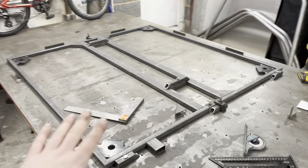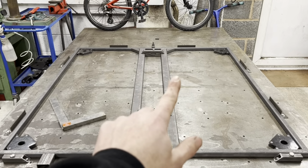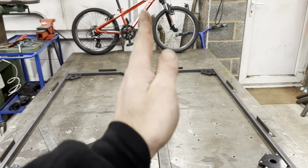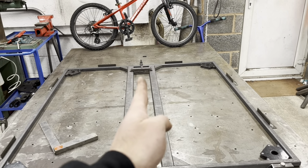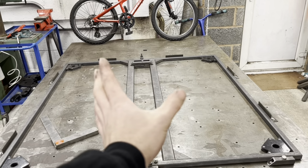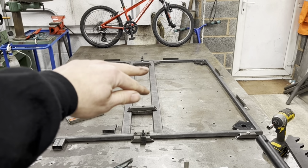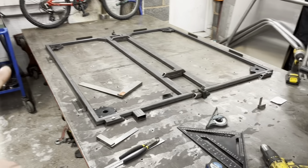Right? But anyway, this is one of my floors. It doesn't have to be one of yours. If you want a single seater, you could take this one off. Well, no, you wouldn't really. You take this one off, move it to there, and you could have your seat in the middle here. As long as it's not dead centre, you're allowed in the UK on circuit racing. If it's not dead centre, you're only allowed centre in an open wheel or a hill climb car. But it has to be off centre in a circuit car. Just for anybody who wants to know. So yeah, you could move this to here, put your seat bars there, and then just tie that in there. But anyway, that's the basis of my floor.